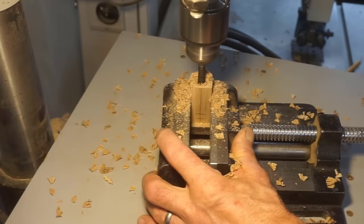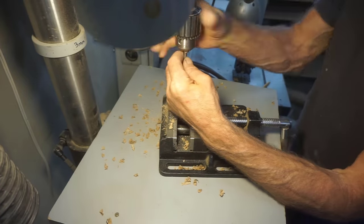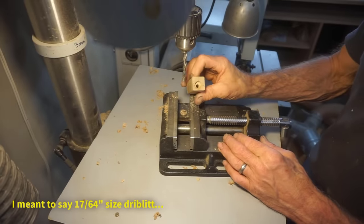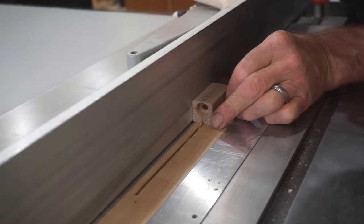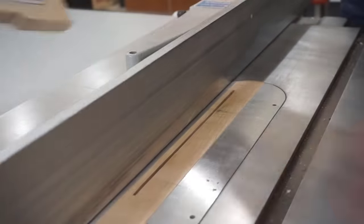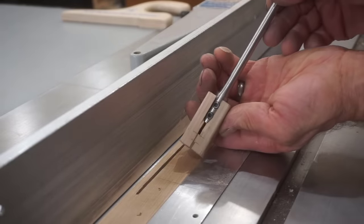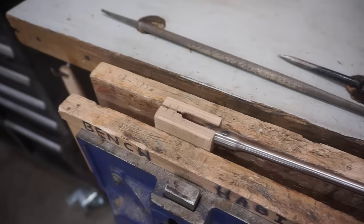Using the center of one of the 5/8 inch holes as a guide, I chase it through with a 17/64 inch bit for the burr shank to pass through — that slight extra diameter assures clearance for the shank. Finally, I run the Seams Impossible block over the table saw blade to center up a 1/16th inch deep, 3/32nds inch wide mini dado through the face of the block to allow clearance for the weld as the block passes through the tube before the weld is cut off. I also widen the slot on the bit extension side to provide access for the Allen wrench needed to tighten the bit extension screws, cleaning up that access slot with a rat tail file. It ain't no CNC, but it's going to work great.